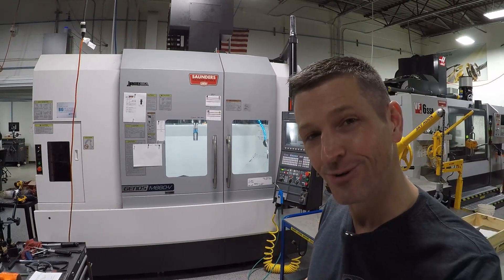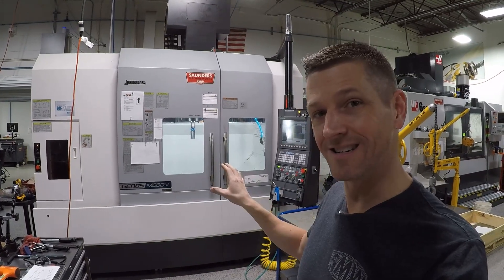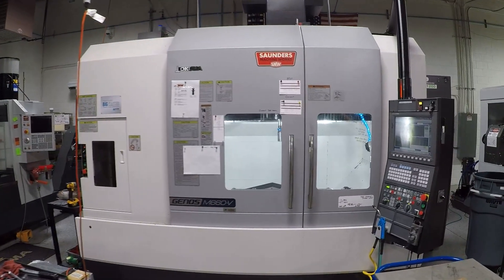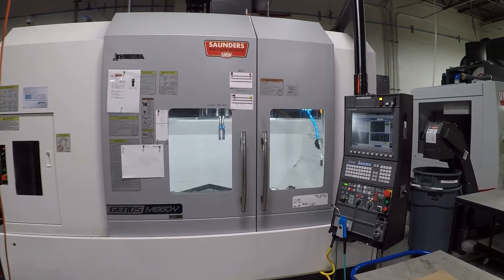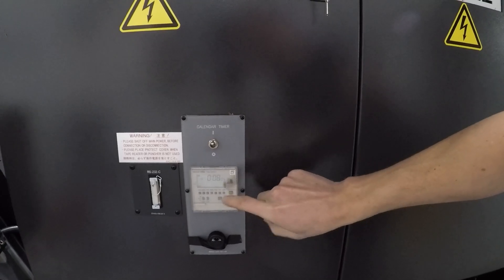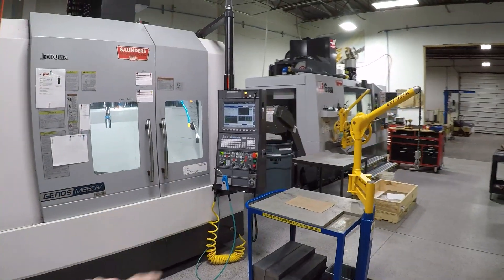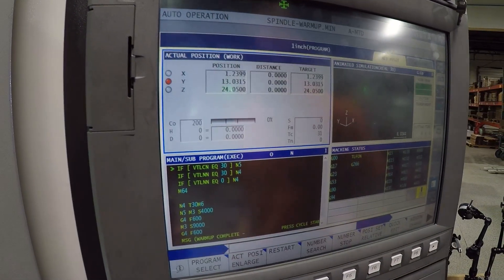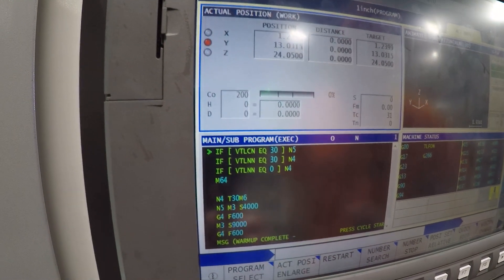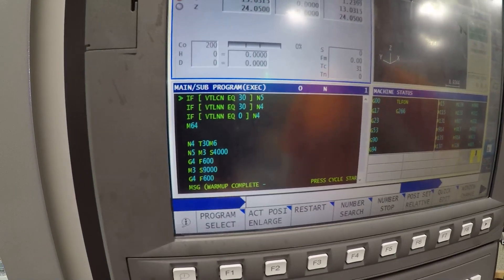A couple of quirks new to us: number one, this machine has absolute encoders — there is no homing it. It knows where it is at all times regardless of e-stop or power cycling. This ties in really well to a feature I absolutely love: a little Omron timer right here. It was a bit of a pain to program, but it warms the machine up every morning. We set the schedule and time, and every morning it turns on, loads a specific program, and because it doesn't need a home or reference — so long as the door is closed and you have air pressure — it runs its own warm-up routine. When we get into the shop, the machine is ready to use.